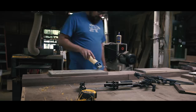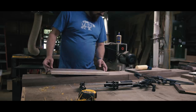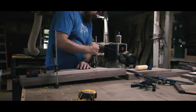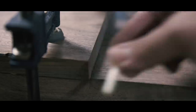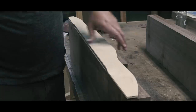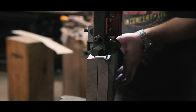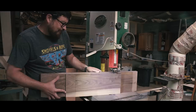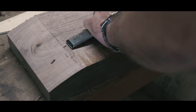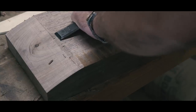While the epoxy dried, I started working on the feet. During the turning process I decided I was going to add an inch in thickness to the feet to give it more of a sculpted look, so I glued on another piece. I cut a template out of some scrap quarter-inch plywood and traced it on the feet, then took them to the band saw. I refined the shape with chisels and then ultimately a belt sander to smooth out the inside and outside curves, though that footage was lost somewhere along the way.